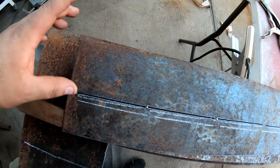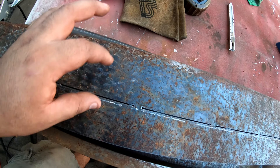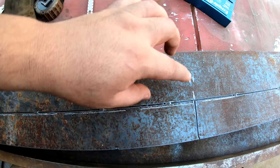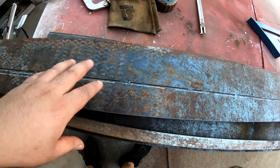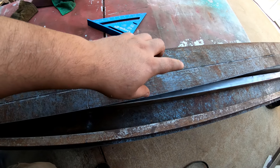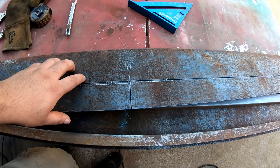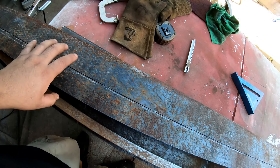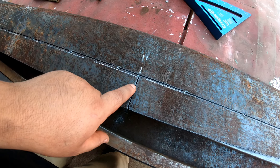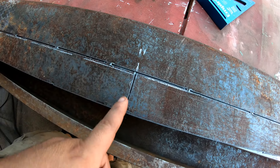I took the plasma cutter and cut this down. As you can see I did some relief cuts through the center - this is my three-inch piece up here, and two and a quarter on the other section. I did that so when we curve this piece to the bumper I can fold it out and determine what lip angle we want. The owner is here now and we're going to play with it until we get the right angle. Once we have it, we'll tack a few places for extra strength while it's already bent so it stays in shape.